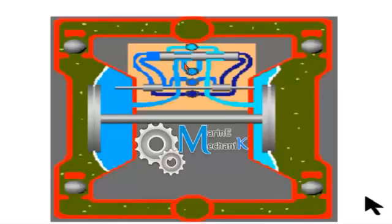So when the air stops going behind this diaphragm, the air is now alternatively diverted behind this diaphragm. So this diaphragm moves out, pushing the liquid out to the discharge manifold, and this diaphragm moves in so that it creates suction, pulling in or sucking the fluid from the tank, or let's say through some pipeline.